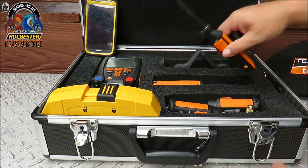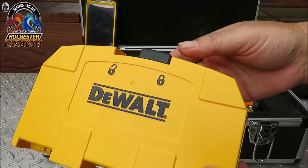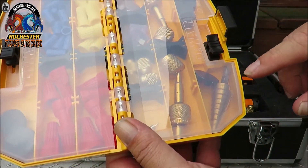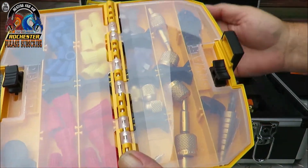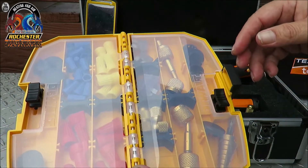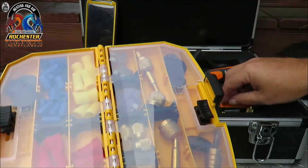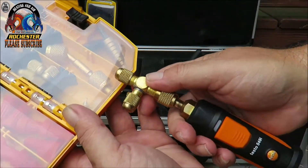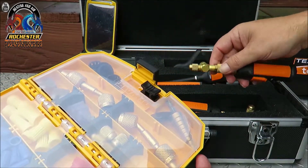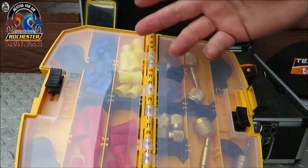I'll show you right now what I actually did — I cut another hole in my case and picked up one of these DeWalt boxes. It makes great storage. I've got my unibit here, which is what I'm going to use to drill the holes for my Testo 605i. The caps I have in here fit perfectly so I don't have to interchange anything. What you're looking at here are micron gauge couplers — you can get them at any Johnstone. They'll actually join right into my pressure probes so I can connect directly onto the unit. This port will be for adding or reclaiming refrigerant.